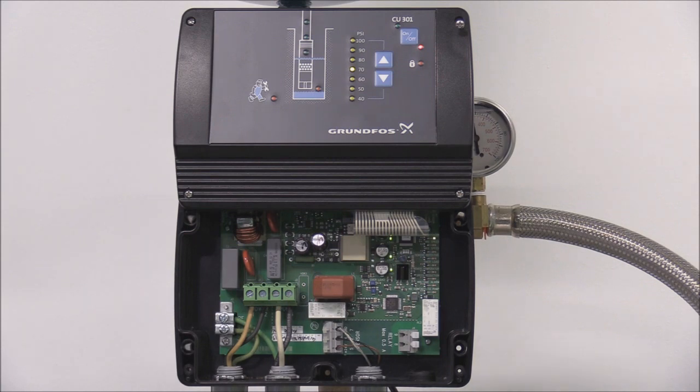When the on-off button is released, the pump will stop if the alarm still exists. One very important thing about the on-off button: setting this button to off does not remove power from the pump. Before doing any service to the pump, make sure that you disconnect the system from the electrical power supply. All this button does is enable the pump to run — it does not disconnect power to the system.